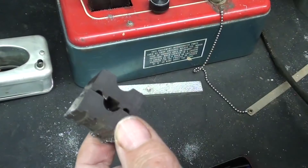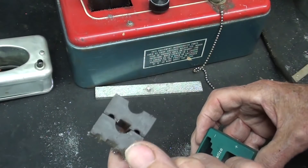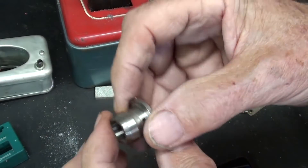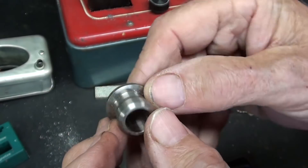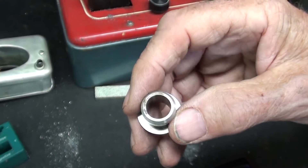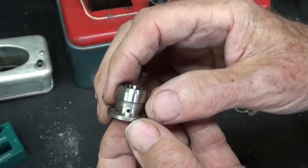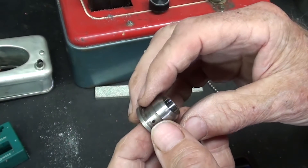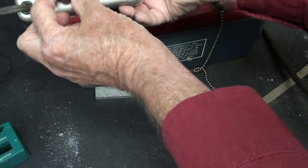Let me tell you a little story. Here's another one — I couldn't find it, got buried there. This is a poor man's, and this is for destitute men. So that's really a cheapie, but maybe it works. Anyway, when I worked at Caterpillar Fuel Systems, I was working in the department where we made these little sleeves — hardened steel, ground very precision on the face and on the inside and on the outside, just to very tight tolerances. This one is scrap — you can see where it didn't clean up there. We made thousands of these, millions actually. And they would become magnetized by the grinders, but there were many operations, so when they were moved from one machine to the other, they had to be demagnetized. An entire basket of them, much bigger than what you see here, would be passed through a demagnetizer.